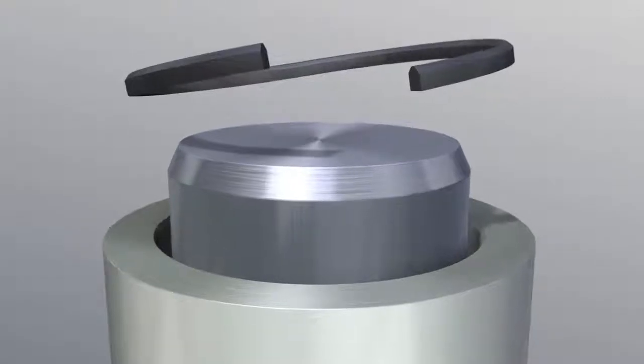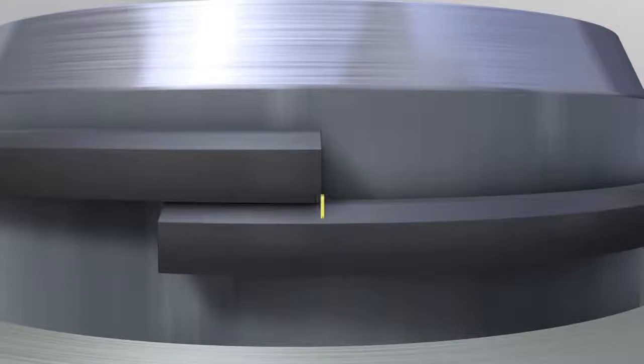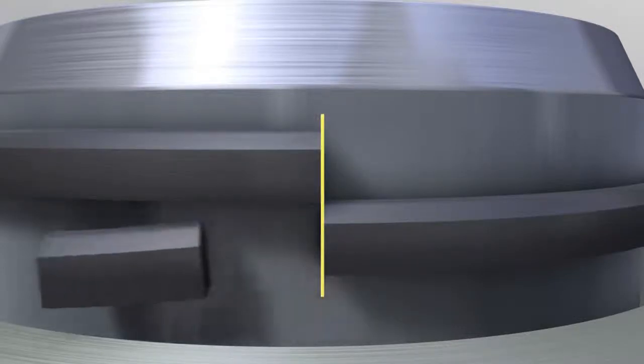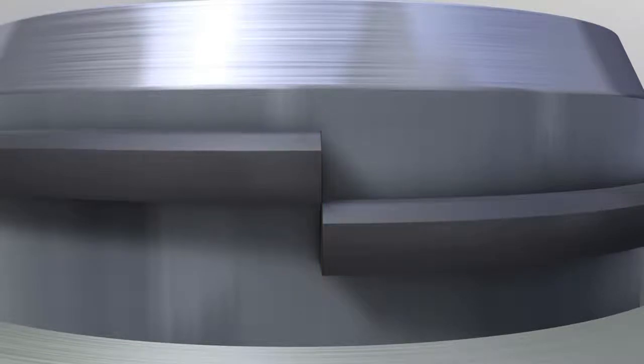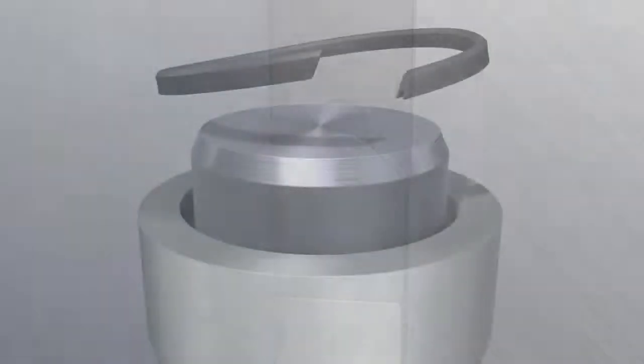Begin with the pre-cut support ring by placing it firmly around the plunger. Mark the excess length and cut the ring to size at an angle of 90 degrees. Since the working position of the support ring is centered within the V-ring, the necessary gap allowance is generated automatically. Remember, while establishing the cutting mark, the support ring was tightly wrapped around the plunger.